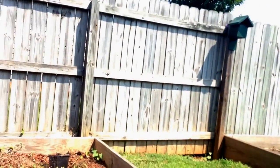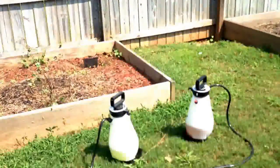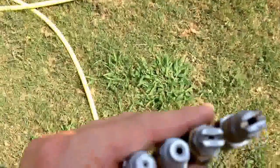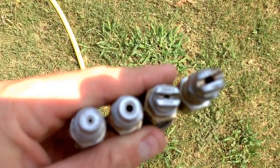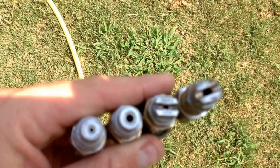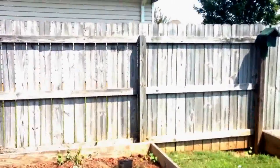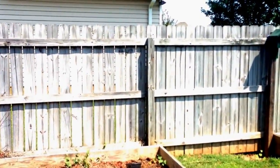While doing this, a lot of guys ask what kind of pressure do you use, what do you use to wash off with? Right here we're using a quarter-inch mag 25-15 rinse tip. That's what we're going to rinse all our chemicals with — that's actually what we're going to pre-wet with too. Never too much pressure. Minimal pressure and minimal amount of chemicals is what you need to clean wood.